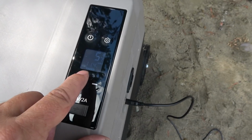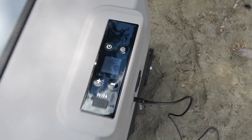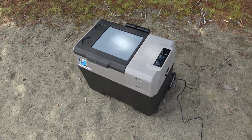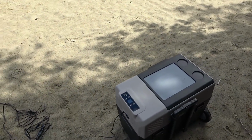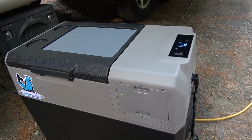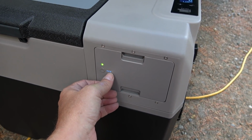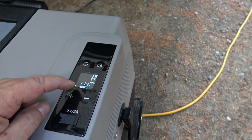Yeah, I don't know if you can see that, but it's starting to go into charging mode. It says anything higher than that. I think this thing takes about 40 watts, so anything higher than it, and it begins to actually charge the battery as well as running it. So we'll let that go while we have some sun, see if we can charge up that battery. Well, I got about 3 hours out in the sun. It was sun and clouds, so it actually did charge a bit. Down here we're back to 3 and saying 11.4 volts here, 4 bars.